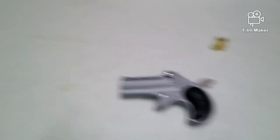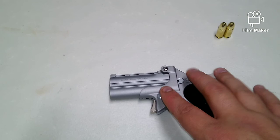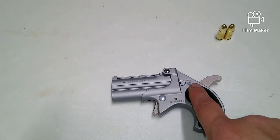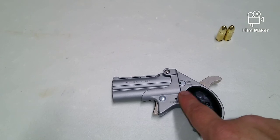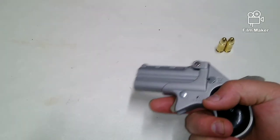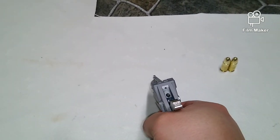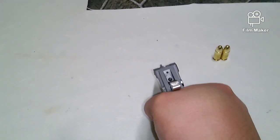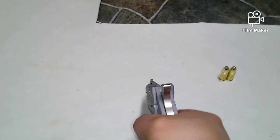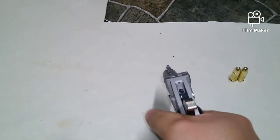I've been working on the internals of this gun. I don't suggest anybody do this — I'm not a gunsmith, and if you try this you could mess up your gun pretty bad. I've taken, I believe, two coils off of the trigger return spring, and this trigger runs all the way back up in here. I've done a little bit of file work in there, and then I put a little bit of valve grinding compound in there as well. Now this doesn't work every single time because my finger doesn't have that much strength in it — I broke my hand at one point. But I've pretty much got it set up to where, for just one shot maybe, I can kind of squeeze that trigger and set it off. It's only good for that one, so I'm just going to stick with the thumb method myself — it seems to work every time.